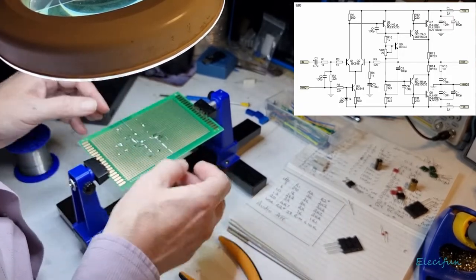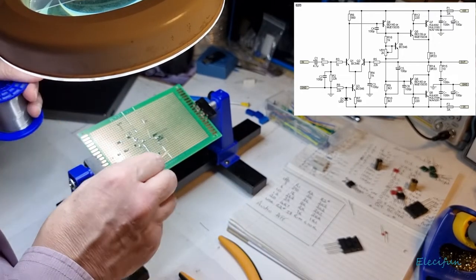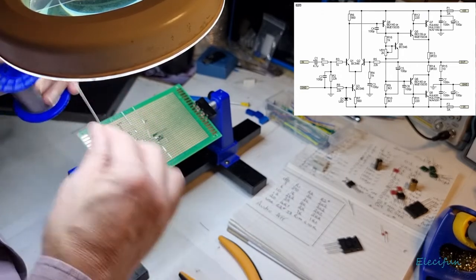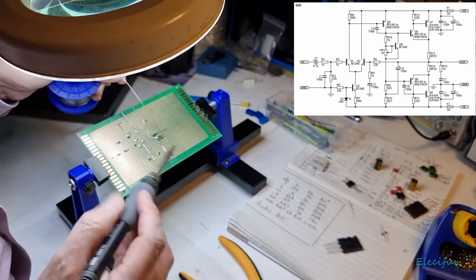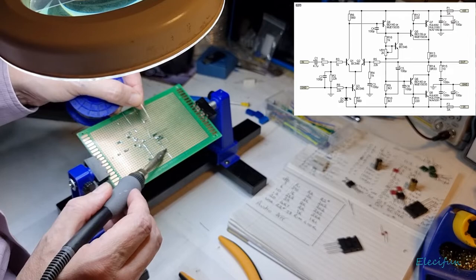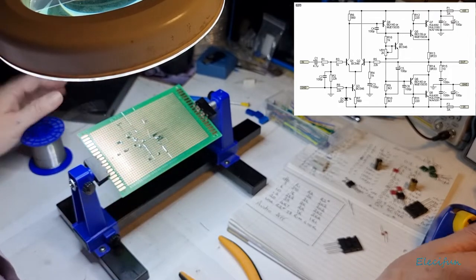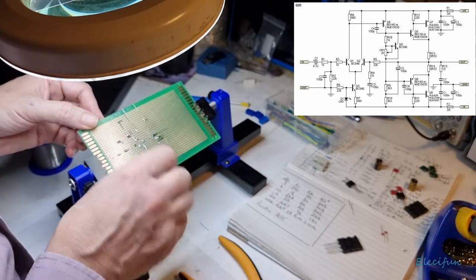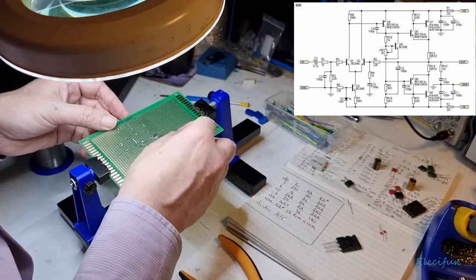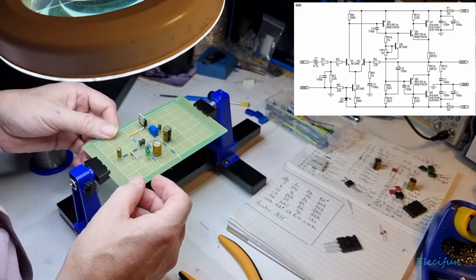Neat enough for me. All right, so we're just going to solder in. And the actual leads there, those just fit nicely to there. That's good. But this will have a bit of heavier solder, which means I'm going to be soldering not just the tab, but a bit heavier like that. It's nice and thick there, because we have a bit more current going through. And as we get down the end, the solder will get thicker. As we're soldering, right, okay.